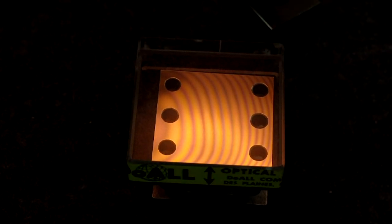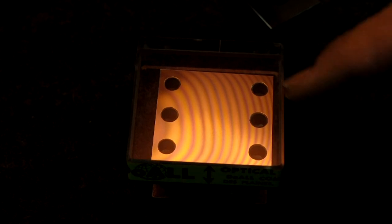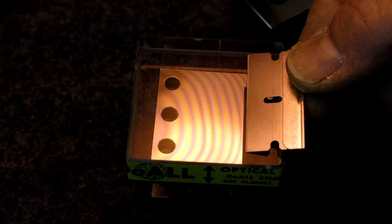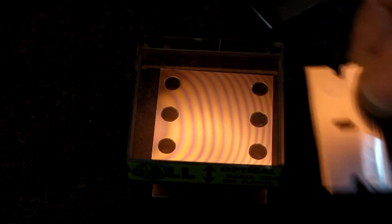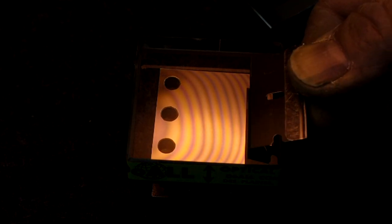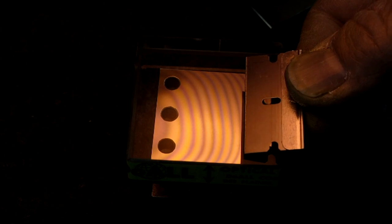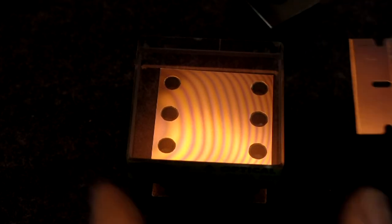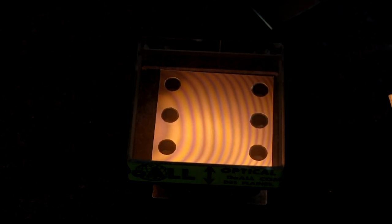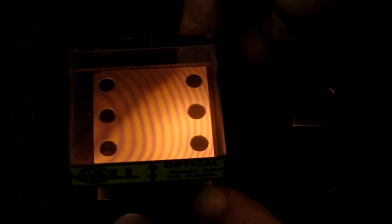The way we read this: if the surface was perfectly flat, those interference lines would be perfectly straight. We read it by how much bow is in those lines — if you draw a straight line across one of them, how many bands does it cut? With my magnifier I can see we've got about two or three light bands right now, and those are separated by 11 millionths of an inch. So the bottom is flat to about 20 to 30 millionths of an inch.